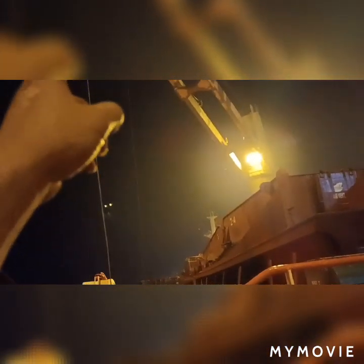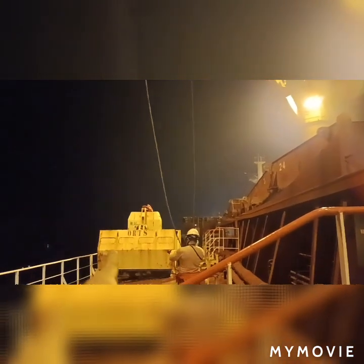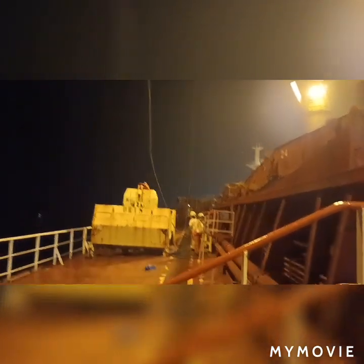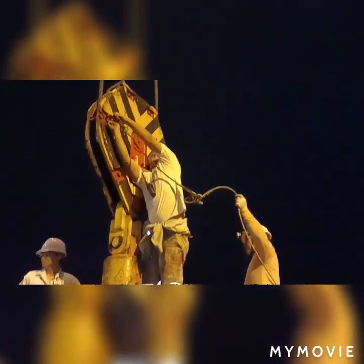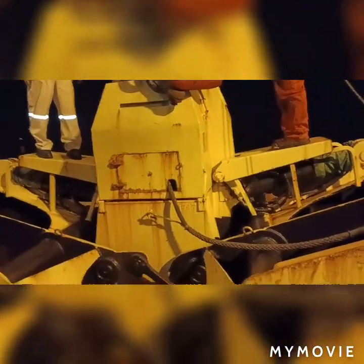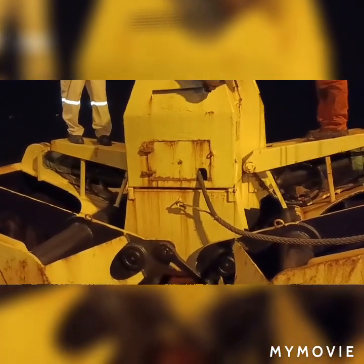What you will see here is the power cable to the grab motors and the other one is the stabilizer cable that holds the cable to prevent it from twisting on the grab. We plug in the power plug on the power socket provided on the grab motors and it's very important to tighten it. This is the string for the cable stabilizer. For testing, we put the cable stabilizer in place, and then we test the grab by opening and closing — normally the grab will open in about 12 to 15 seconds and close in about 10 to 12 seconds.